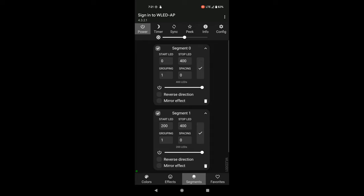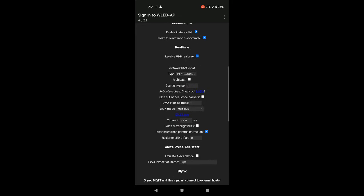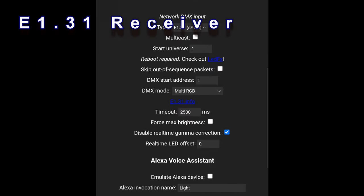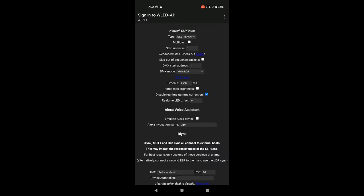How do I turn this from a self-sufficient controller into a part of your light show? That all comes down to the sync interfaces where it actually acts as an E131 controller, and you can see this in this setting. What you need to do is add this IP address to your Falcon Pi Player or to your XLights scheduler, and it's another node that can be controlled with E131 data. As you can tell from the shows on this channel, it's pretty powerful.